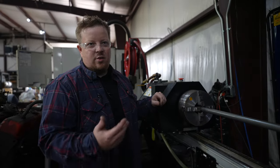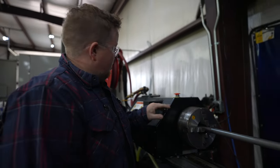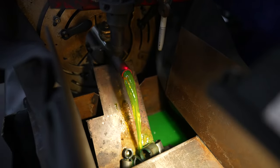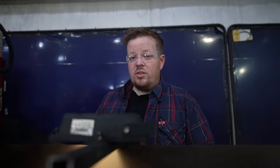Got a valve back here that controls the flow for our coolant. This does have through-spindle coolant, so it gives you a nicer cut on the Dragon. It helps with the plasma edge and the dross. It's pretty much ready to go — got a Bluetooth controller that controls the coolant, turn it on. What that coolant's going to do is keep the dross from sticking to the opposite side of the tube, keep the part cool, not distort it, not warp it, and it makes for a really nice clean cut.